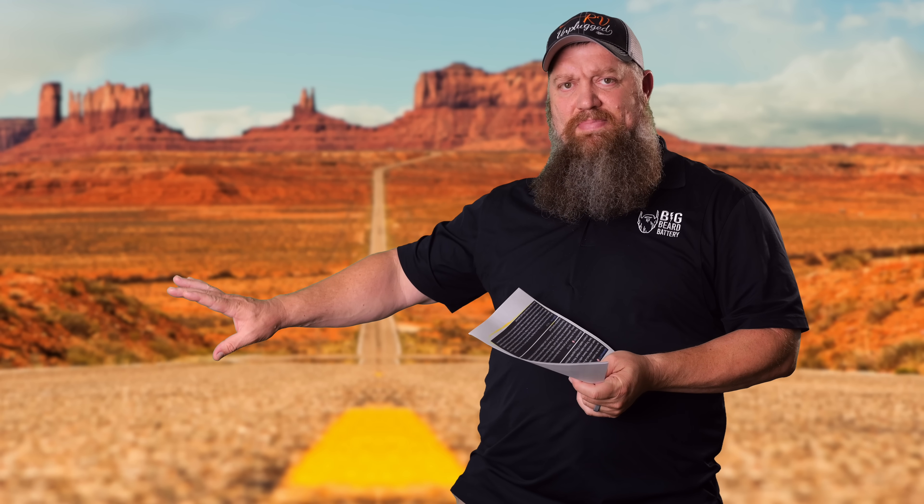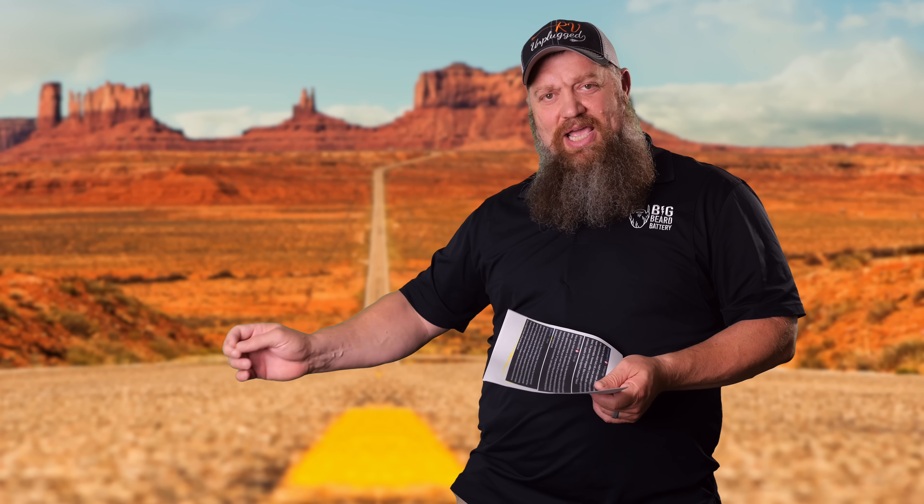You also asked: do I prefer the permanent side or the temporary pedestal? I do not like the pedestal. I'm still testing it, but here's my concern — it creates a brownout situation for other capacitor-style devices like a refrigerator. I'm sending a modified variable frequency to a refrigerator and it can go into brownout mode, starving that compressor because there's no capacitor on it.